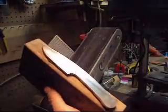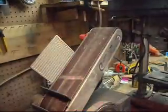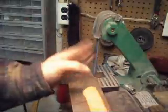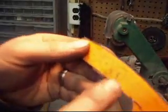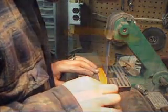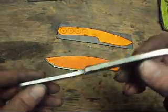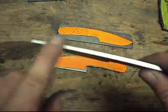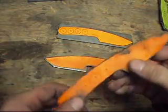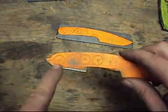It's all sanded smooth now — no need to get all fancy with it since I still have more grinding to do on this blade. Next step after flat sanding is to take it over to the 1x30 belt sander and get closer to the pattern. Here are the three processes we've gone through so far. I used 80 grit on both belt sanders — the 1x30 and the 4x36 — that's what I use on all my knives. The next step is to mark my holes with a center punch.